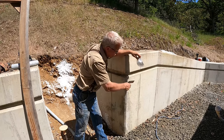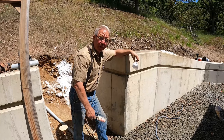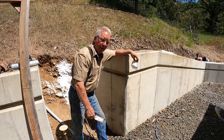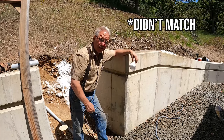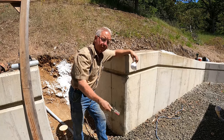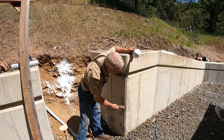The cement I use for this is made up of about 60% white cement and 40% gray. I do that because it ends up pretty close to matching the color of the standard concrete service mix design. Different aggregate and different sand in different parts of the country make a different color concrete. Part of my original trouble here was that the mix design on that wall over there didn't match. I'm hoping to color it — 50% sand, 50% cement, with the cement being 60-40 white to gray, mixed up with a little water.